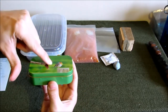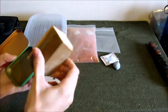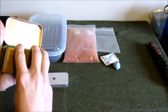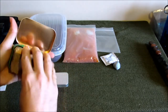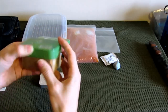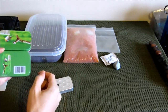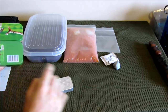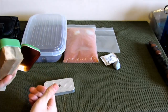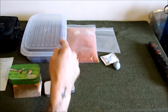I'm going to punch the holes in. Because this tin will flex and end up deforming, what I've done is just carve a little wooden block so it fits nice and snug inside. So once I actually punch holes in this, it won't bend the metal down and it'll be a nice solid block. I'm going to punch holes just like the commercial one has, through my tin, fill it with some silica, and put some rubber bands on top. There's no need for a screen because I can just take the bands off, open it up, and see what condition my desiccant is in. I'll give you a quick close-up of the different colours and then get started.